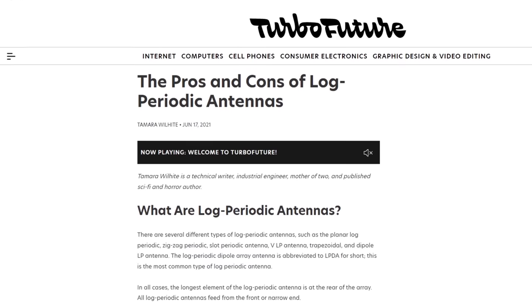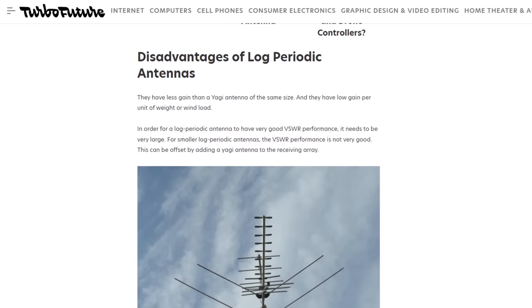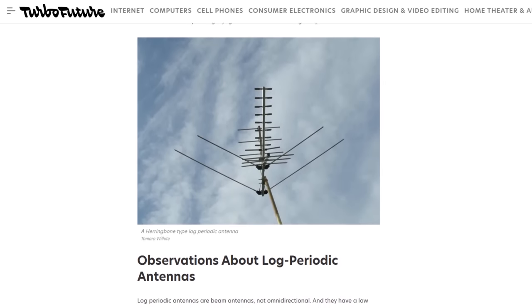Although the traditional style antennas are quite large, they typically aren't true Yagi antenna designs, but rather use a hybrid log periodic wide design. The trade-off with log periodic antennas is lower gain for their size for a wider frequency design. A true Yagi design, such as this Range Experts antenna, packs in a lot more gain in a given area, whereas a log periodic design requires much more size and more elements to have comparable gain. For those who want to learn more about the differences between a traditional Yagi and log periodic style antenna, I've included some informational links in the description of the video.